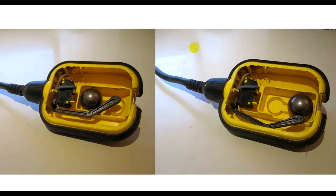Here is the inside of the float switch. There is one ball — a steel ball. When the float switch rises up, the steel ball will drop to one side, and when the float switch drops down, the ball will touch the switch and the switch will give the signal to the pump. So it can turn the pump on and off following the position of the float switch.